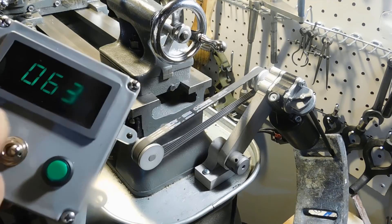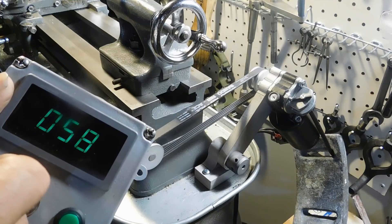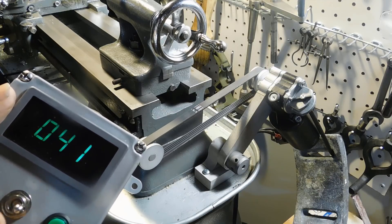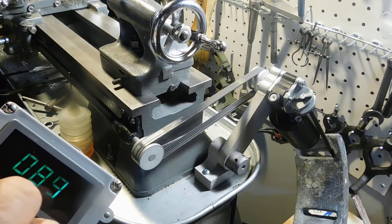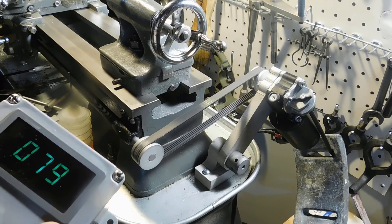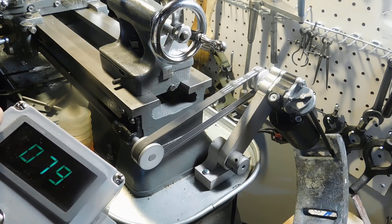There's the forward direction and that's at 64%. Let's go a little higher — that's about 100. For a finishing cut I was using about 40, that's about what I was using. You can shut it off, go to the other direction, turn it back on and now it's going in the other direction, and we ramp it up to 100. So it all cost me less than $50 — probably about $45 all up. I also sandblasted it so it's ready to accept paint; I think the next step is to take it apart and put some paint on it.